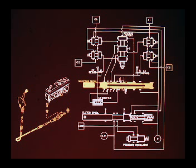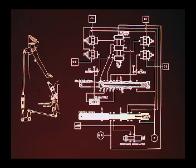The selector spool is mechanically operated by actuating the power shift selector lever on the operator's console. The selector spool is used to supply pressurized oil to two clutch pilots in each of its detent positions. The clutch spool is also mechanically operated by depressing or releasing the clutch pedal and has the purpose of neutralizing the drivetrain with the pedal depressed.